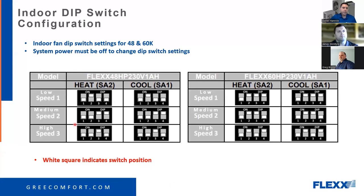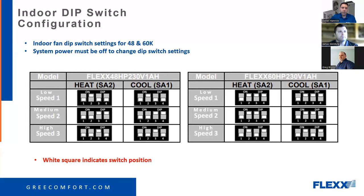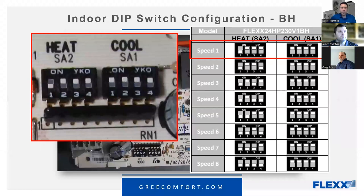As you can see, there are different settings — this is just the A-series at the moment. Hopefully you're already familiar with this, but as James was saying, the heat and cool are set the same across the A-series. As we move forward into the BH revision, you'll notice the dip switch settings are different between heat and cool. On the cool side, they all stay the same across all models of the B-revision air handler — you're not adjusting the cool settings, just the bank labeled 'heat'.